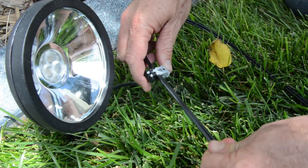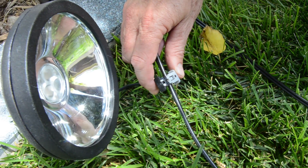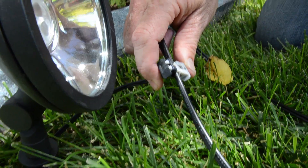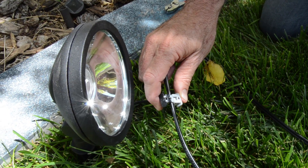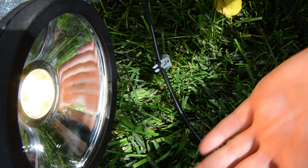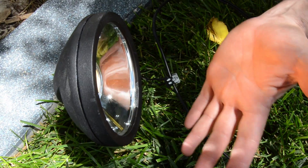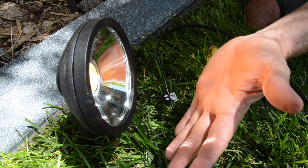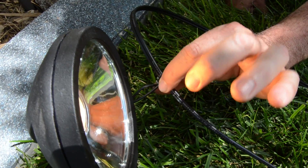For the test, we went out on the wire laying in the grass, 75 feet out from the transformer — halfway — and connected a 7-watt LED light. We're going to go back inside, get a voltage reading both at the transformer and at the end of the wire. Every time you add a light fixture you change the parameters and change the voltage on the wire. The light is on — even in daytime a 7-watt LED is a very bright light source. One nice thing about the Malibu LEDs: they're not harsh white; they're more balanced, more natural-looking, and closer to the output of a halogen bulb. The quick connectors make it very simple to attach the light fixture to your main power.